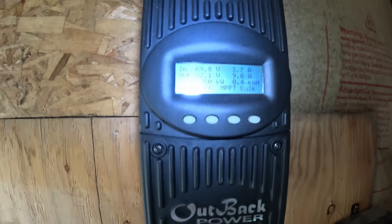On the charging side, you could have solar panels, microhydro, hydro, wind, or a generator — there are lots of options. In all of those options you're going to need something to do the charging. You can't just take solar panels and wire them directly to your batteries; you need a charge controller. Same thing with a windmill or hydro. With a generator, you'll need a charger, which takes the 120 volt and converts it to DC power at the correct voltages and amperages to charge your batteries.